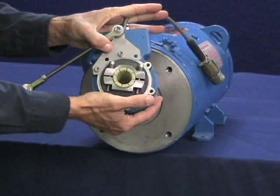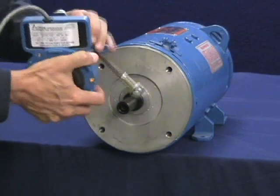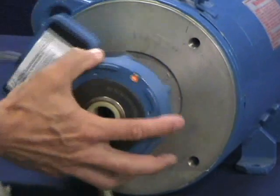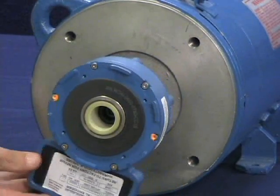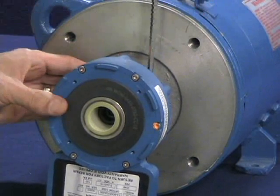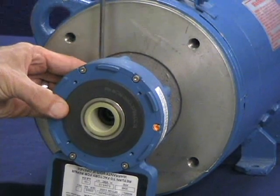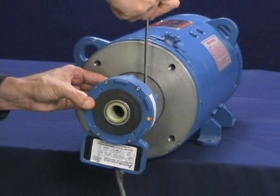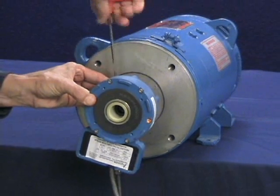Carefully slide the XP45 onto the shaft. Do not force it. The encoder should slide on easily. Do not hammer the encoder onto the shaft. Tighten screws on clamping collar evenly until snug, then firmly tighten. Do not use a standard right angle wrench for final tightening. Use only a T-handled hex wrench or torque wrench with hex bit.